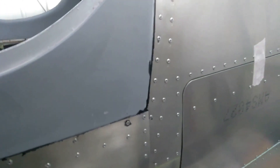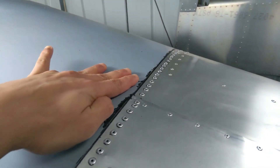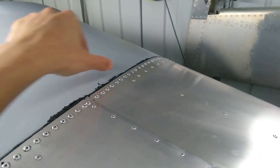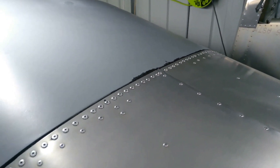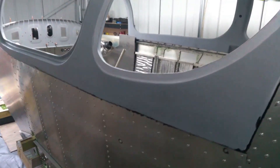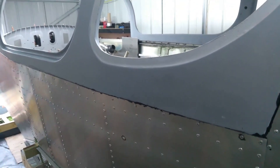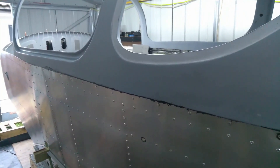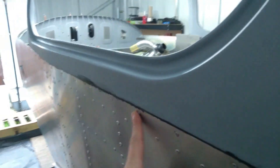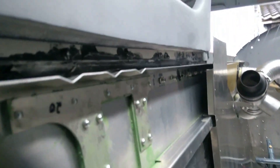Apart from that it went quite well — the top line came out really nice. There's a little bit of primer spill which you can sand off, not a big deal. The primer and activator chemicals are quite nasty stuff, so it needs to be a well-ventilated area, and the temperature should be around 10 degrees, which is what's recommended. The only thing I did differently was with the rivets — the 3.2mm rivets along the top line. The standard ones are 8mm long, hardware 142, but when I put the 8mm long rivets it didn't look like they would come out well on the other side.